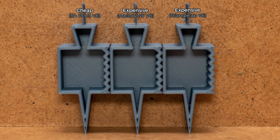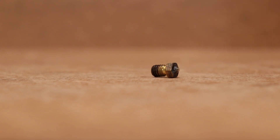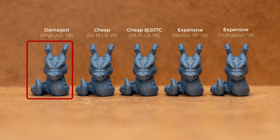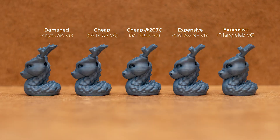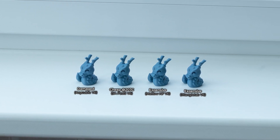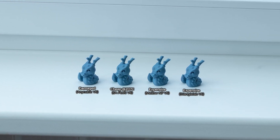That gave me an idea of how bad a nozzle must be before we start seeing a noticeable difference. To do that, I took a nozzle that had a lot of mileage, sanded the bottom from the burned PETG plastic and just drilled into it with a tiny drill bit. Surely this will make the print look horrible, right? Well, again nope — it just looks a tiny bit worse. And these are close-up shots; if we look in a more evenly lit environment and from a realistic distance, it is almost impossible to spot any difference.